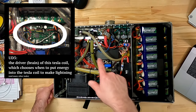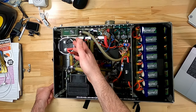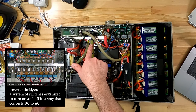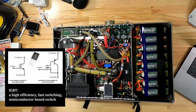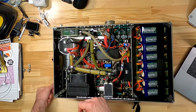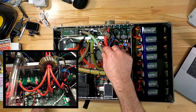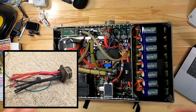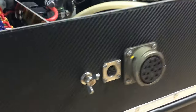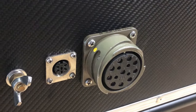We charge the capacitor and that cap is connected over to the bridge. The bridge has eight pairs of IGBTs—16 total, eight separate bridges. That's why we need such a large, strange connector: we feed all the outputs of all eight bridges into that connector. It's a military connector with a mil spec number, used on old communication gear—probably Vietnam era.